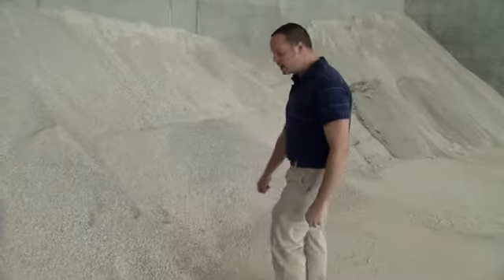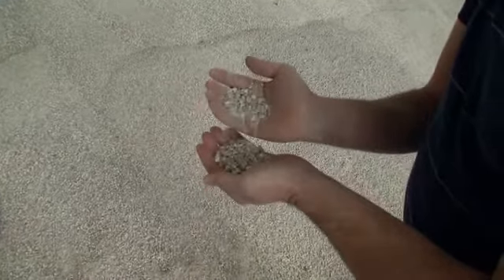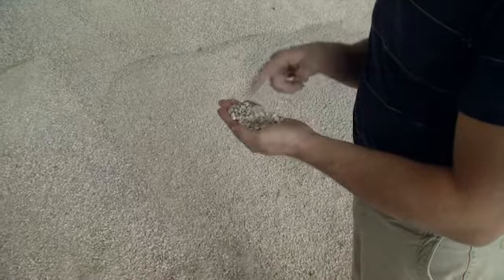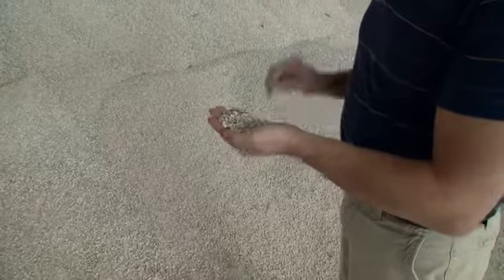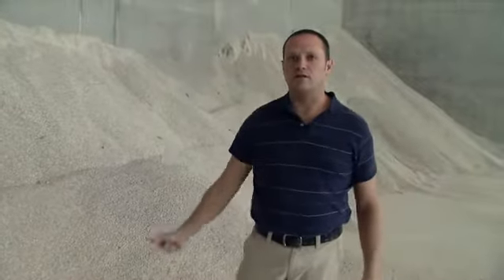As you can see here, we've got our pile of ground-up tiles already. We grind it down to about a quarter-inch size. This allows us to process the tile through our process without jamming up the equipment. You may be wondering, with all the different colors mixed in — does that affect the processing? Not really at all. It's such a small amount, and this is a small portion of the body compared to the other raw materials, so it really doesn't affect the overall color of the tile body.